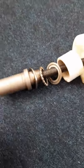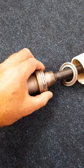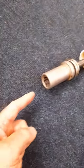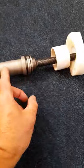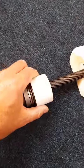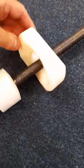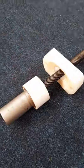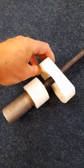These are okay but in a few years I might replace them — they're starting to feel a little bit lumpy. One race sits there, your ball bearings in a cage sits in that race, and there's a top race. The top is where you put your winch handle, and right down there is the bottom. There's a plastic cover for your ball bearings, which will all get greased up with the correct marine grease. I'm going to use a white grease — we can discuss that another time.